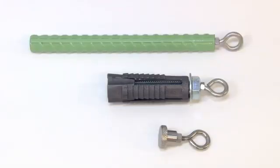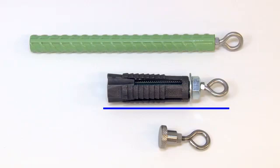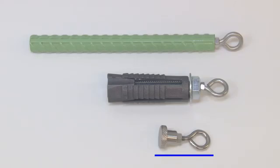It is recommended that one of the following 3 anchor points be used: a groutable anchor, which is essentially a 3/4 inch piece of rebar with an eye bolt threaded into the end, an expanding wedge anchor, or a weldable anchor that may be spot welded to steel supports.